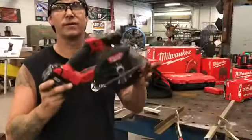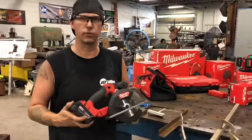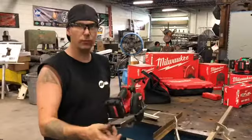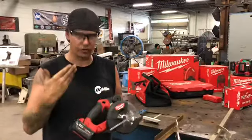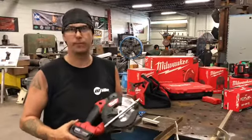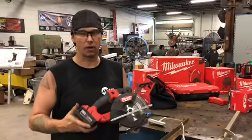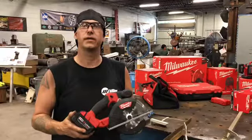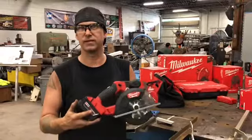This tool is going to do a great job replacing some of the very expensive cutoff wheels that we use — we usually use the 6-inch cutoff wheel, and a lot of times we're using it sideways, which requires a face shield and safety glasses. This is just going to require safety glasses. We'll get many more cuts off one of these wheels than we would the fiber cutoff wheels. I'm really strongly considering getting another one or two of these to add to different workstations throughout the shop so each person can be using them. It's safer and it's faster.